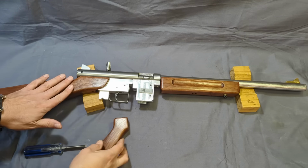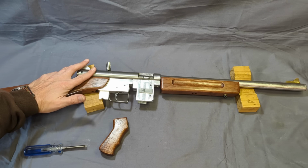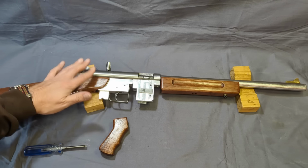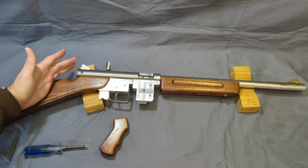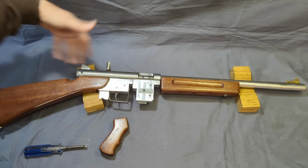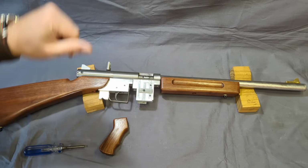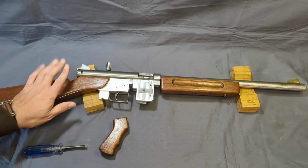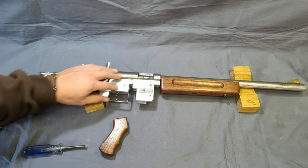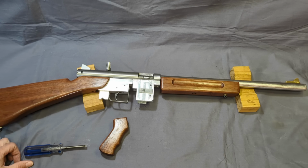I was going to say a few of the comments about shooting this thing. For sure, the bolt is slamming back against this plug, and that is a little jarring to the weapon. Some screws will sometimes come loose. You really don't want that. There's mitigation ways. You can put springs back here, buffers, just pieces of rubber, or you could make it where it doesn't slam the back. The recoil spring would stop it and go forward. So I was going to say that this design is not flawless. It's a little jarring back here, and so sometimes I'll notice a screw or something might be shaking a little loose. And you can probably see from the video for 380, it's kind of punchy.